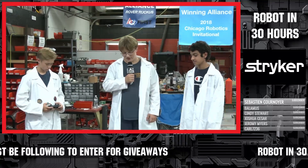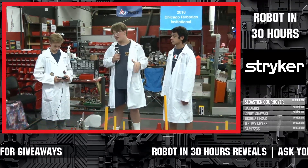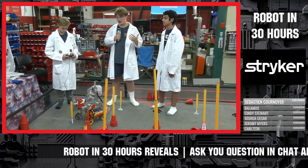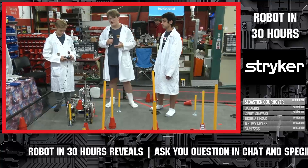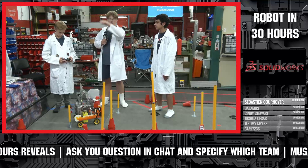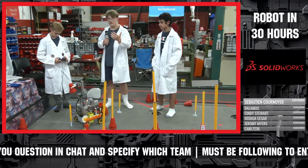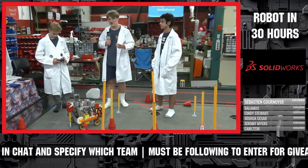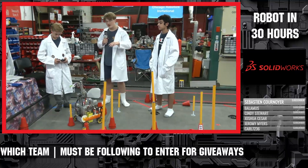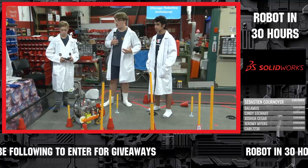We originally thought the claw would be straightforward — we could just add it onto our slides and we'd be good. But then we started realizing it would get more complex than just that. So we ended up using the flipper, which was actually from last year, to bring the mechanism over to the other side of the robot. And that's when we realized that when it flips to the other side, it's upside down — which is actually a penalty. So we had to add the articulated wrist to flip it right-side up so we could score properly.